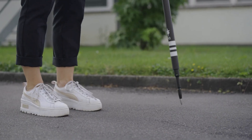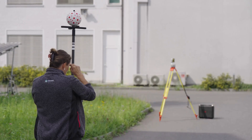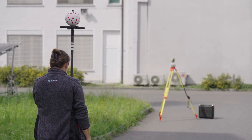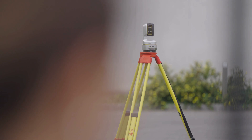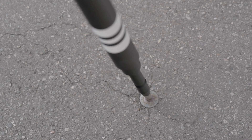It is very important for the V-Pole tip to not move during the calibration. First, place the instrument at least 5 metres away from the V-Sphere. Connect the instrument with the ICON Trades app. Make sure the tip of the V-Pole is placed on a stable location, for example a survey marker.